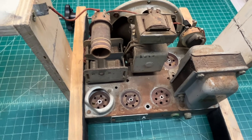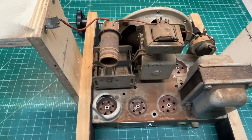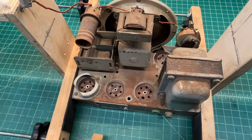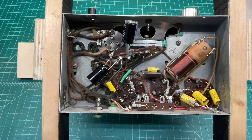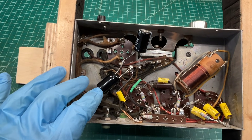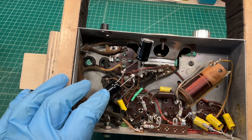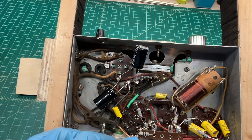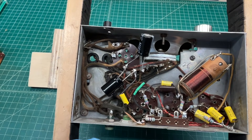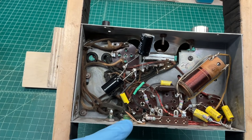Here's a better look at the chassis with the tubes removed. It's not one of the worst ones I've seen — I think I can get the rust mitigated. Looking underneath again where I left off, just having the ecaps tacked in on the terminal strip, and no line cord or power cord at this point — just had that clipped on to do some testing of the circuit.